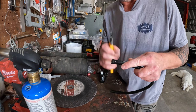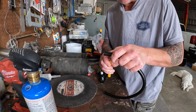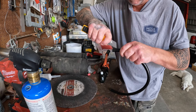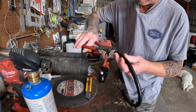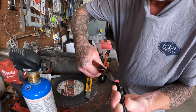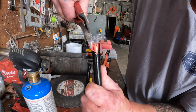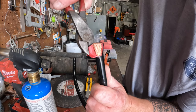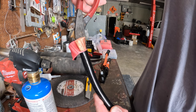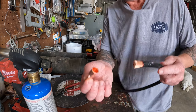I use a knife and do it by feel, because you don't want to go into the copper — there are very small strands in here. As I'm grabbing the insulation I can see I'm ripping it, not cutting all the way through. You can see how I'm peeling it, and you can see where it's actually ripping apart — which means my knife didn't cut the copper. All the insulation is being ripped, so I know I didn't cut the copper. There's my copper stripped. You want to use 100% copper.